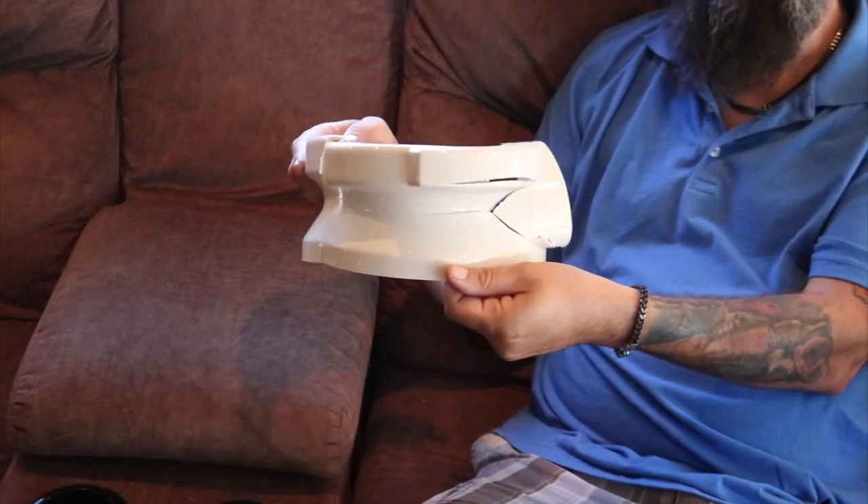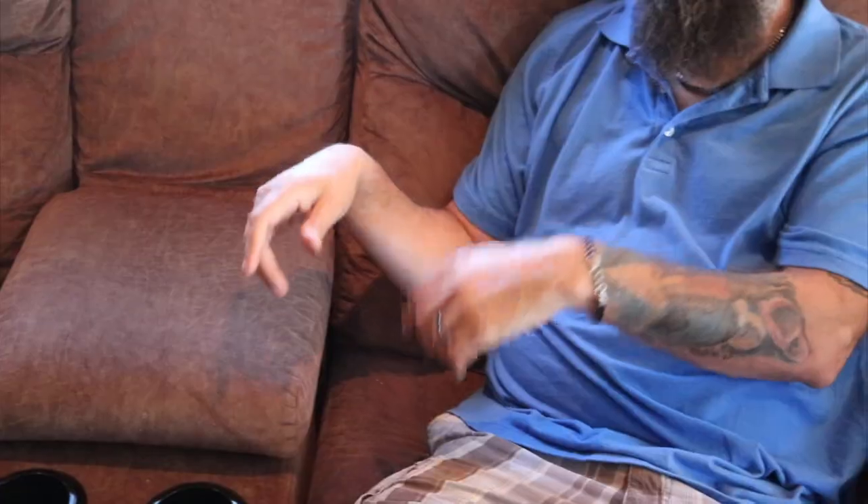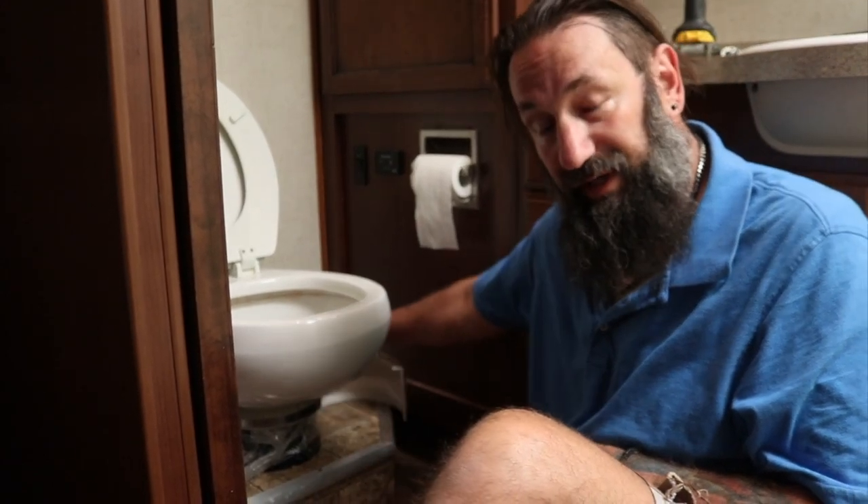Here's the plastic wrap we stuck over the ball to help create a seal so the other toilet would work. I told them not to flush this at all because it would rip the seal. You can see the vacuum is pulling it down — just opening it once broke the seal. We're going to take this toilet off, toss the plastic, and bring in a brand new toilet. Before you start removal, shut off your water, then open a faucet to relieve any built-up pressure so water doesn't pour everywhere when you disconnect the line.